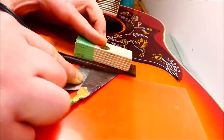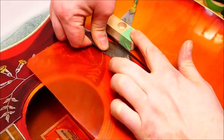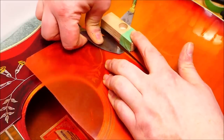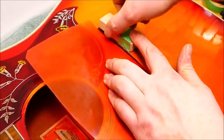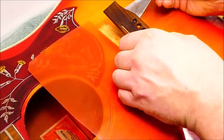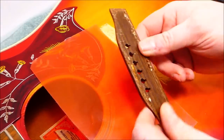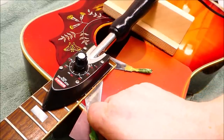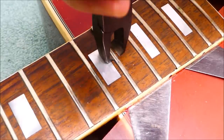I remove the bridges in my usual way. This is a silicone heat mat. Different glues were used on these guitars. The Hummingbird has sort of this sticky white glue that Gibson was using in the 70s — it's pretty good stuff. The bridges don't seem to come off very frequently with this glue, and you're about to see it's kind of like pizza mozzarella. It's the same for the fingerboard extensions. I'm using my sealing iron here, and while the 15th frets are still hot, I'll remove those.